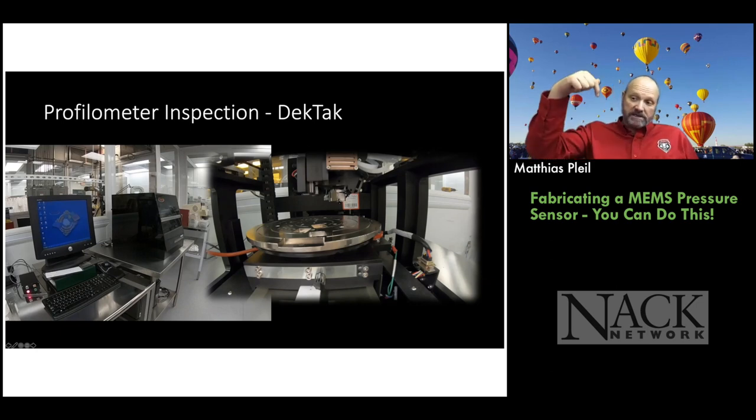And it's reminiscent of, those of us old folks will know this, the cartridge or the needle on a record player. Okay, so you know it comes down, then the record goes around and around, and the needle goes up and down and creates an electronic signal that's converted into sound. Well, this thing goes up and down and converts into an electronic signal that shows you the topology of the surface.